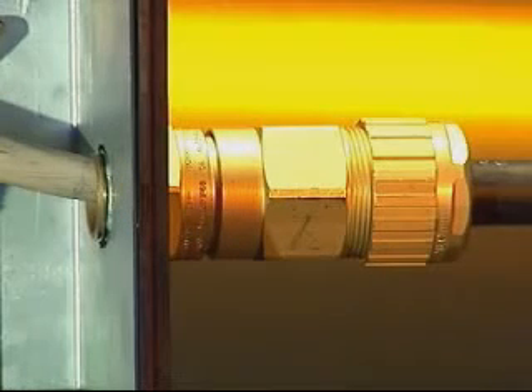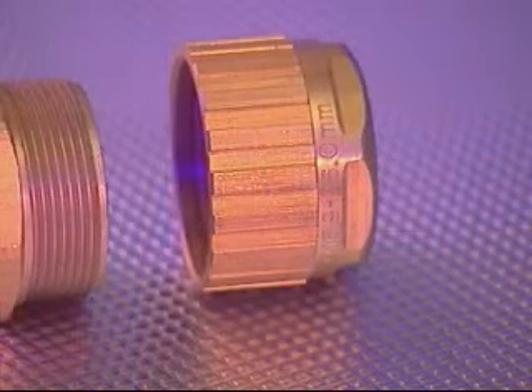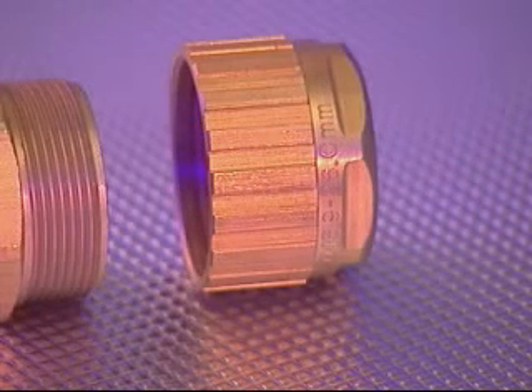The 501453 RAC or 501453 dedicated cable gland has now been correctly installed. Please note: cable acceptance sizes are marked on the clamping ring and back nut for armor clamping range and outer sealing range respectively.